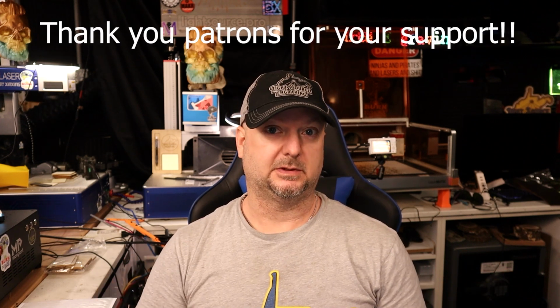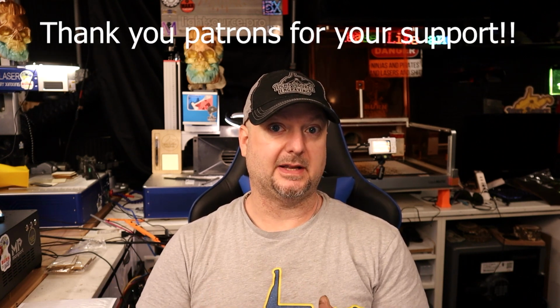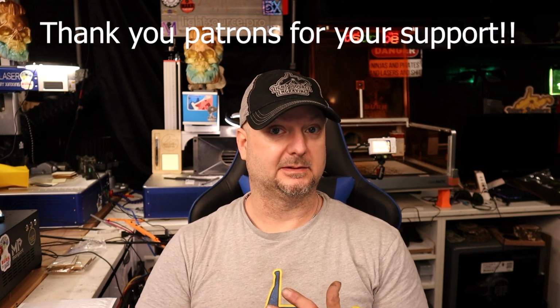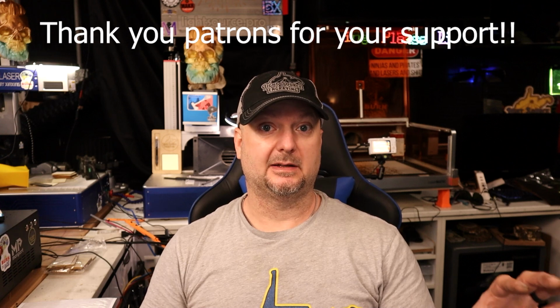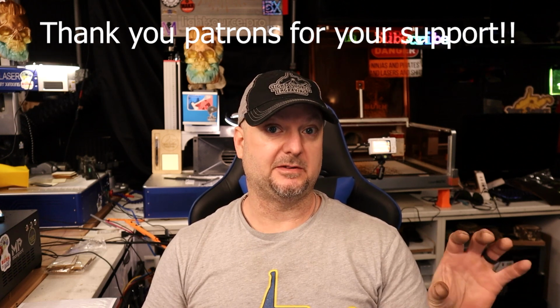Today I have a quick tutorial for you. What I want to do is take an image of an object, copy and place that into LightBurn, then use that image to create a template around the outside of that image or the object. Then we'll use that template and a couple of simple tools, poster board and masking tape, or poster board and magnets, and draw on our laser bed exactly where that object needs to go to be perfectly framed.